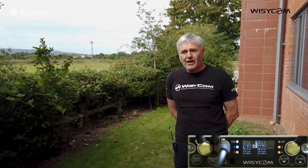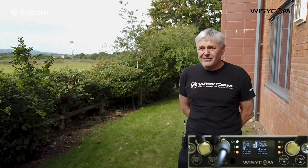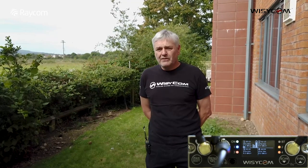We've got quite a bit of frequency spectrum available between 961 and 1154 megahertz, all licensable. We're going to go for a walk now. We're using a frequency licensed at 962.650 megahertz today, and we're going to see how far that goes relative to a normal 600 megahertz channel.